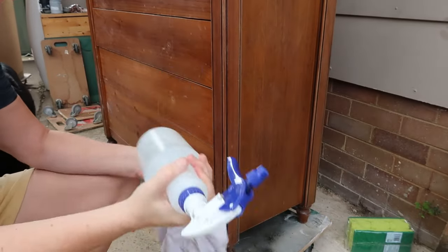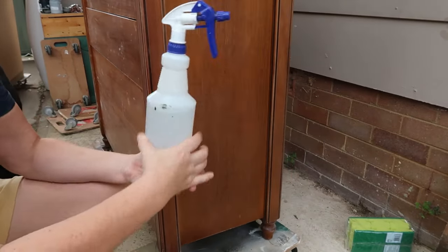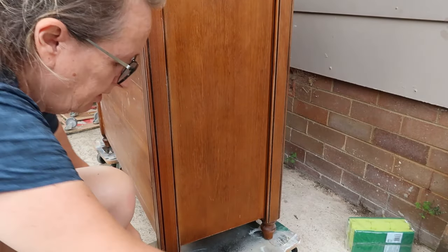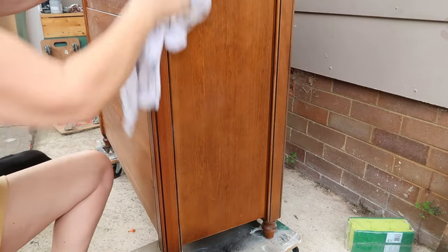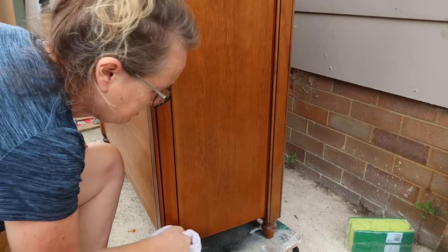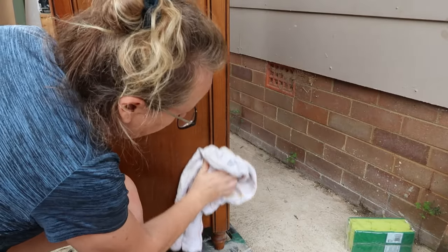Cleaning time. This is my pre-mixed Dixie Belle White Lightening — I'll do the same with Carts and Millie when I start using that, but I've still got about three pots of White Lightening. I just pre-mix it — I've done a video showing how, it's not rocket science, just put some powder into water and shake it. After cleaning you need to rinse it off with plain water so there's no residue, otherwise it can create what we call a resist, which will basically resist the paint from adhering.